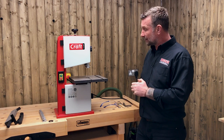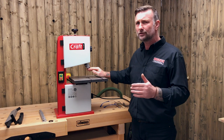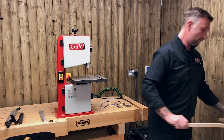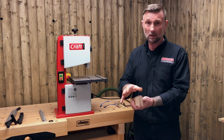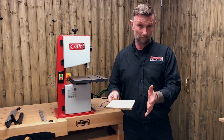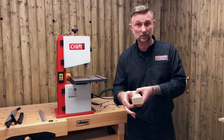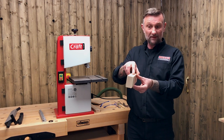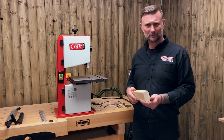It's the smallest machine in our range — you've got about two and a half inches, 63 millimeters under the guides, but that's height under the guides, not necessarily the depth of cut it wants to achieve regularly. A machine like this handles thin material well: three-quarter inch 19mm maple hardwood is not a problem, thin ply certainly not a problem. We have the capacity for some bigger cuts, some two-inch softwood, but please bear in mind this is a small machine. If you need to cut that sort of stuff regularly or even bigger, you might want to invest in something else later down the line.